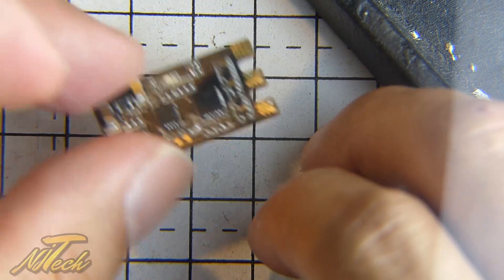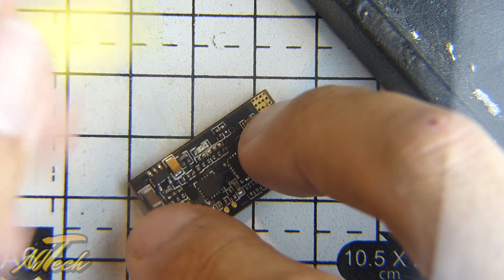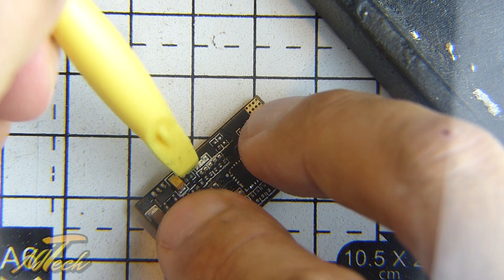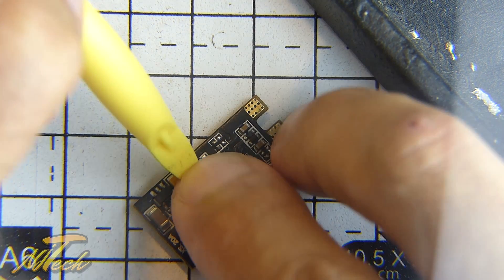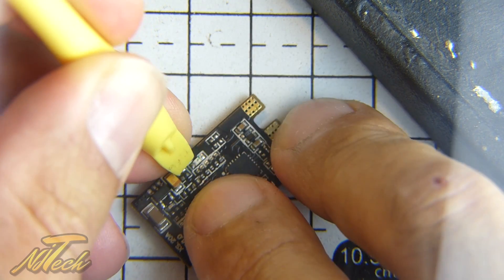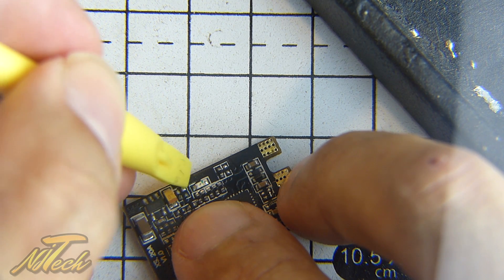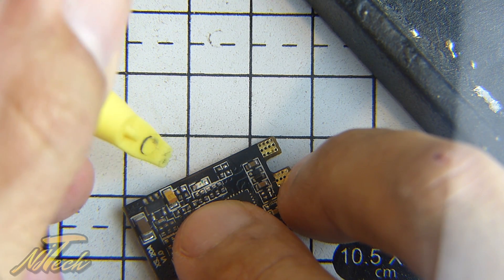You don't want the board to be warm or anything. You want to make sure it's cold, because the colder it is the more brittle the solder is. And as I said, there's such a tiny amount. So I will take — you see this has got like a little lip — I will actually put the lip on this side of it because I'm going to drag it off this way. Then I'm going to use my finger as a point of leverage so I'm not stressing any other part, and I'm just going to do that. And if we look — there it is — there's the capacitor and there's the two points where it was very lightly tacked on. Nothing's been lifted, no trace has been lifted. It's literally as simple as that.